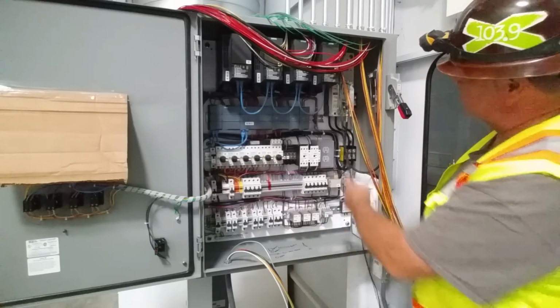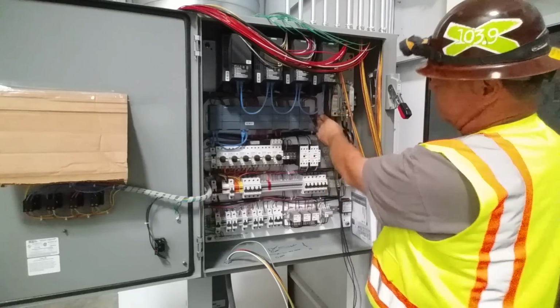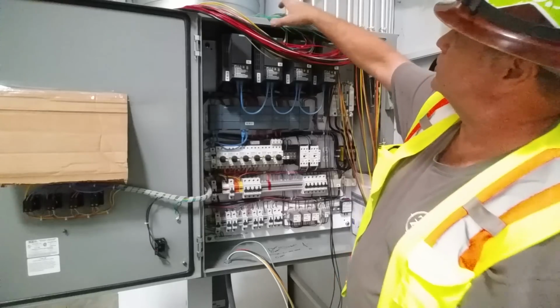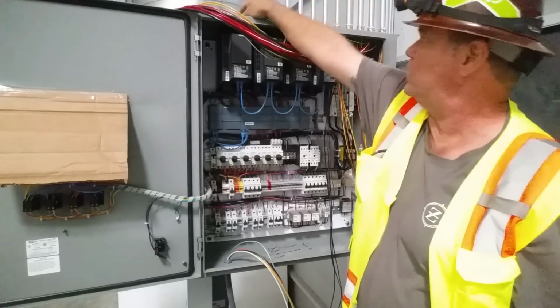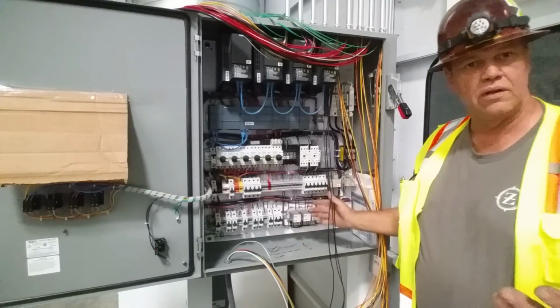We've got a thermostat cable here, and that's to the side, and that's going to get tucked in the back. We've got all our 110 and low volt stuff here. And up on top, we've brought all our grounds together. So we've got all our greens right here put together. We've already done some preliminary segregation, and it's already looking better, right?